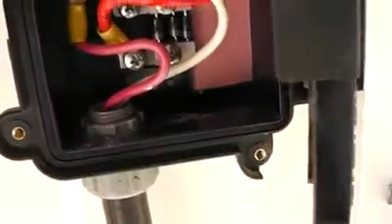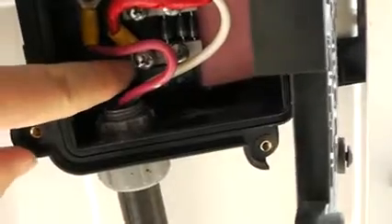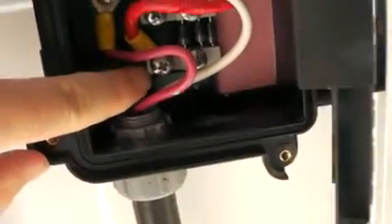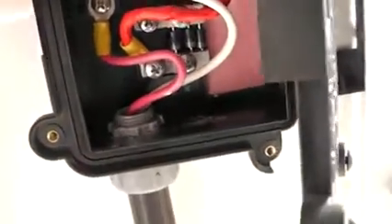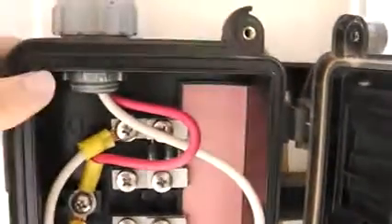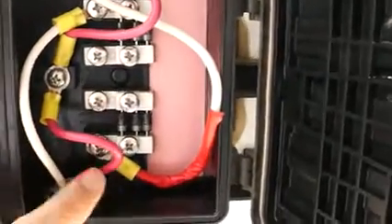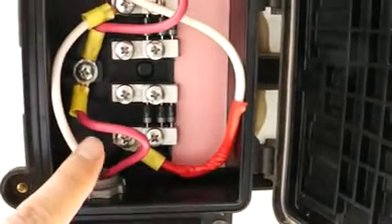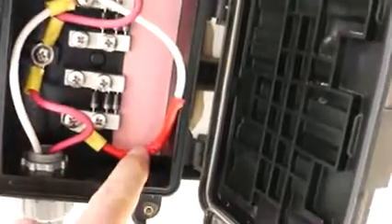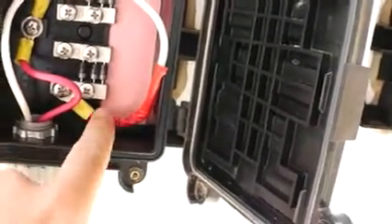The positive comes in here to this terminal. The negative goes to what is actually the positive terminal here, and then this negative goes in. This will go into the next solar panel, which is right here. You can see the white wire coming in here and it's actually going to the positive terminal. We actually tape this off as red — it starts off as negative but we tape it off as red because we're connecting it to the positive.